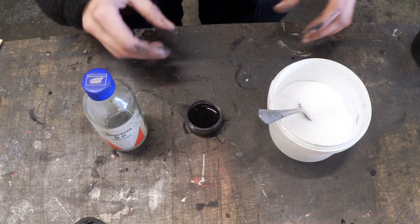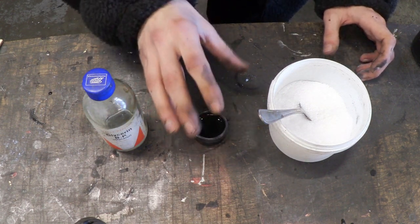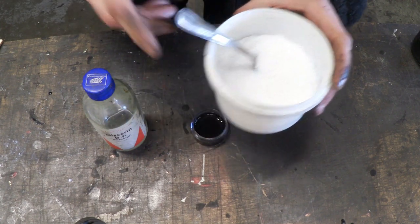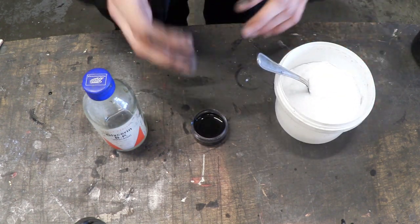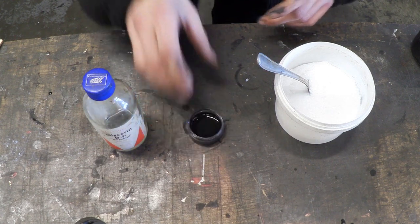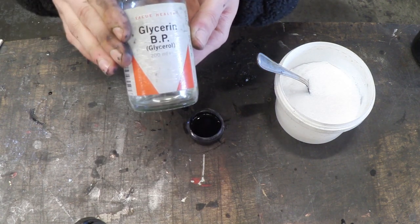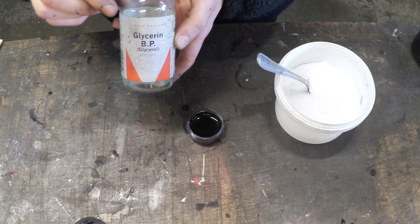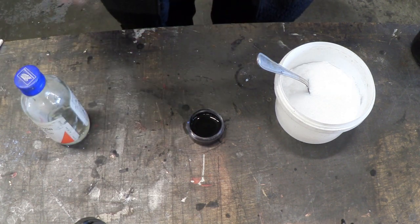So I've got my three ingredients right here. We're going to be using our conductive ink with graphene. And then I've got a gelling agent right here, which is fumed silica. The reason why I chose this is it shouldn't interact with the properties of the ink. And then I've got a little bit of glycerin or glycerol, and we're going to add a tiny, tiny little drop — this is going to act as an anti-drying agent.